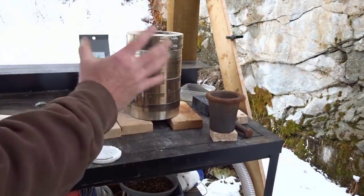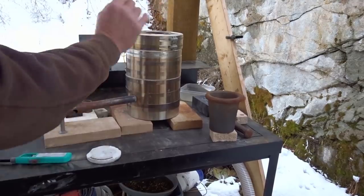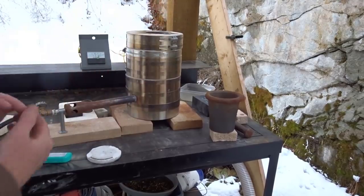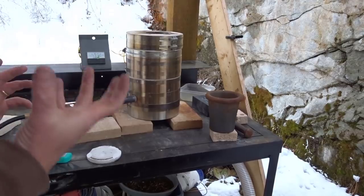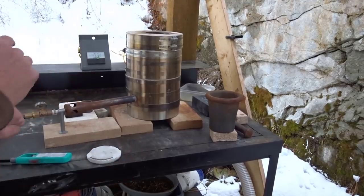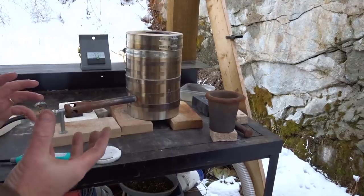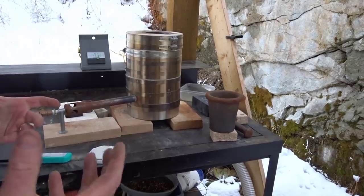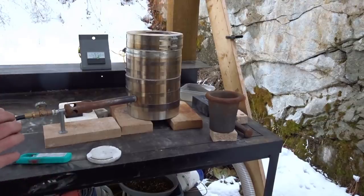A little bit of technicals here when it comes to smelting. We have to bring the whole kiln, everything in the kiln, up to 900 degrees. 900 is important because that's when the chemistry starts working in there. Bring it up to 900, leave it for 20 minutes, and let some of the fusion, the chemical reactions, occur at that lower 900 degree temperature.